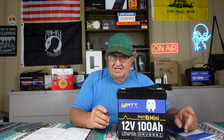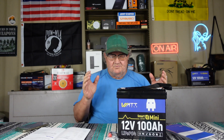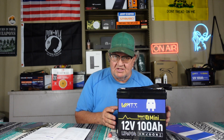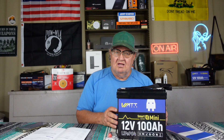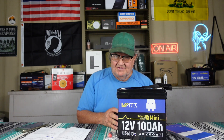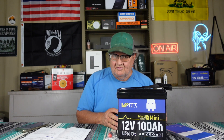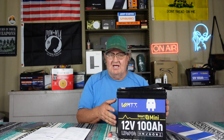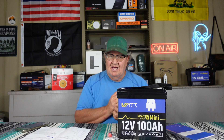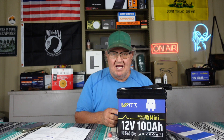The price is right — that's another thing. To get the features of this, the price is right. I'll recommend these to people. You can charge them with a 20 amp, 14.6 volt charger. Remember, lithium — you've got to charge with 14.6, not 13.5, to take full advantage of the capacity. You can use a 20 amp or a 50 amp 14.6 charger. I only have a 20 amp. I took them down to zero and they went back up to 100% in about two and a half hours. With a 50 amp charger, it'd probably be about an hour. And 1,250 watt-hours will last a long time before you have to charge it back up.